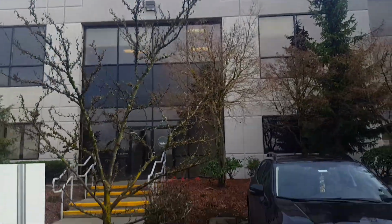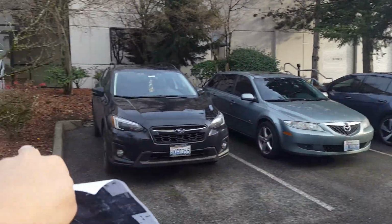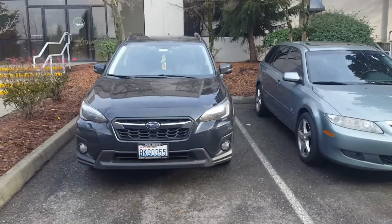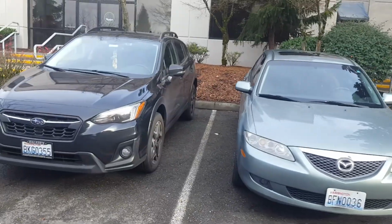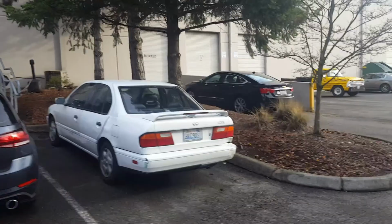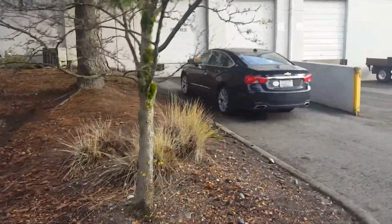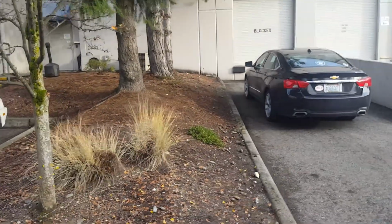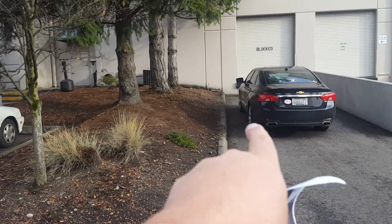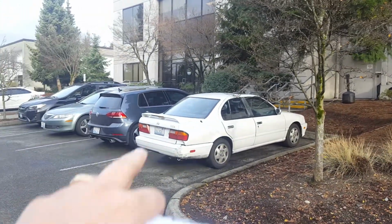So that's at the northwest corner of the building. He wants to take that 8 feet from over there, that loading dock, and use it right here. So we need to mark that as maybe B1, call that 8 feet, and then change letter B to 27 feet. Under letter B, go 27 feet, leaving that little chunk, and then putting in B1, 8 feet over there.